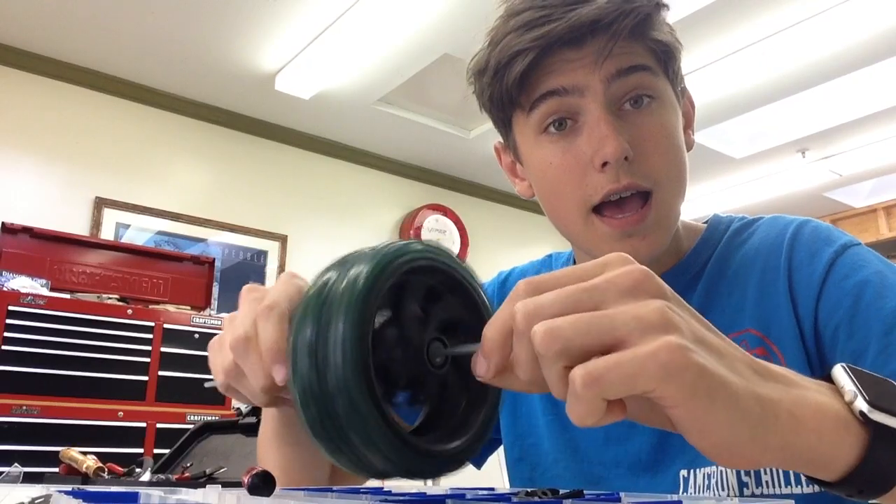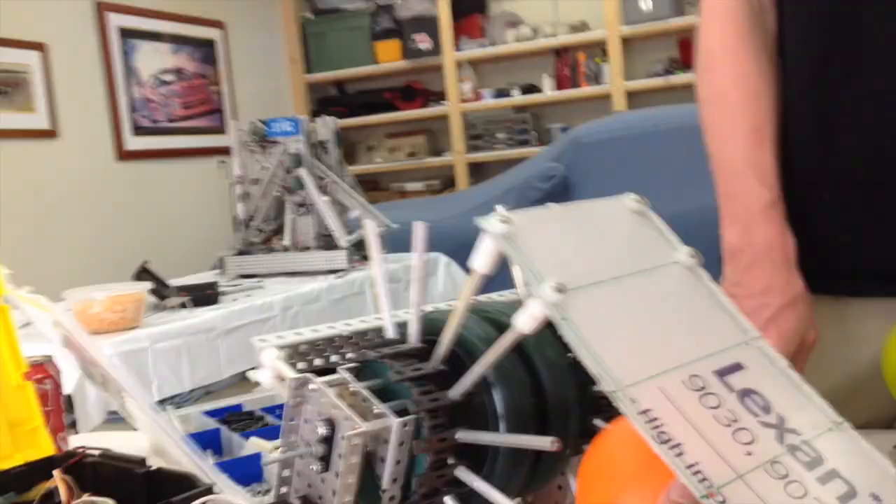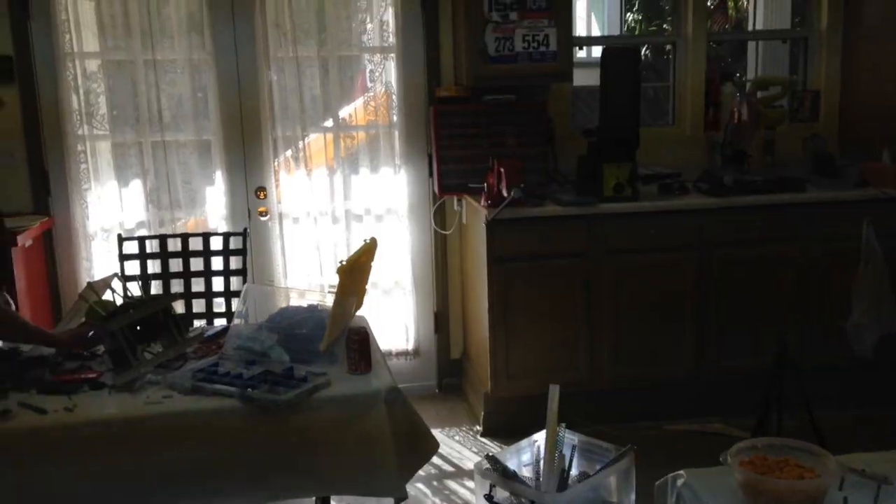The accuracy of the single flywheel with the hood is really good because it puts a lot of spin on the ball. However, as you can see in the video, it's not shooting as far as needed. We think that's because of how much friction there is on the top hood surface. So now we're going to continue on with the other two designs.